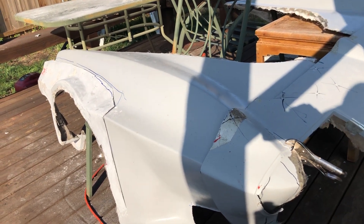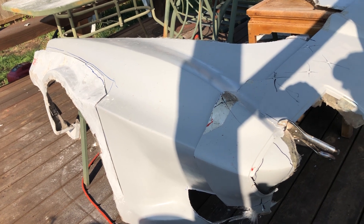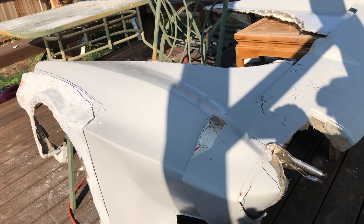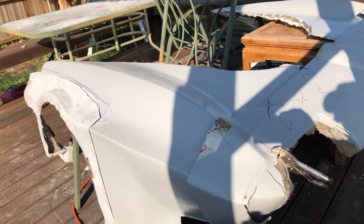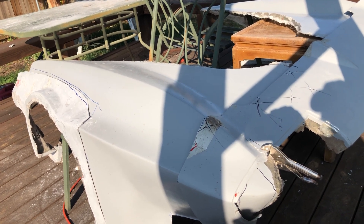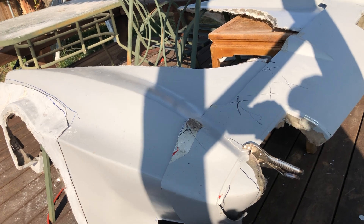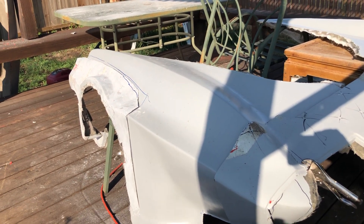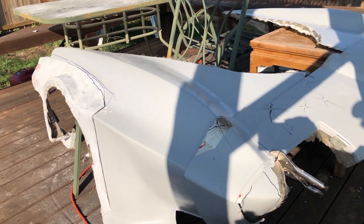There is the fender flare. The fender flare came from that damaged mold and I went ahead and sanded off the orange gel coat that stuck to it. I'll hit it with some primer to smooth it out — it's only for test fitting and visuals, so it doesn't need to be perfect. It just needs to be what I'd call a 20-footer.